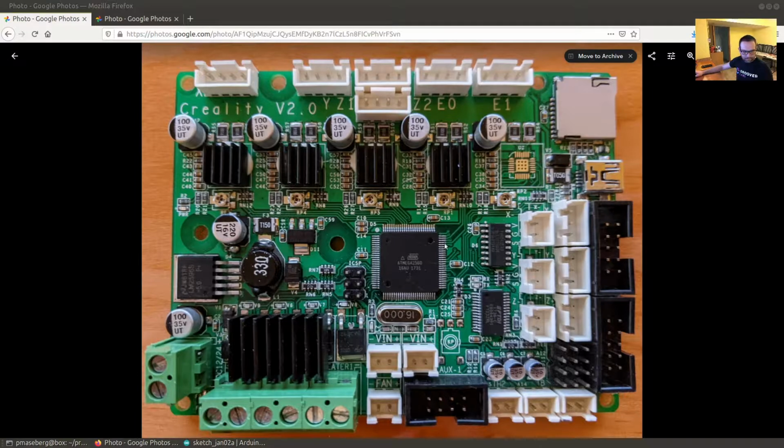The main thing that you're going to be looking for on these types of boards is the ICSP header, and that's these 3x2 pins right here. In my case, I have an MK2 programmer, and it has the same header on a little cable, so I can just connect that once you know which orientation, and so you might have to look up which pins. This header actually stands for the in-circuit serial programming header. Once we have the bootloader installed, we won't have to use this anymore, which is nice because it's a real pain to get to, but that's what you're going to be looking for. And on this board, it's right out here in the middle.